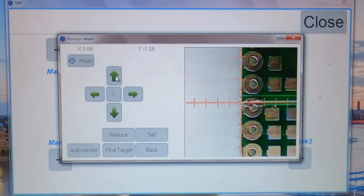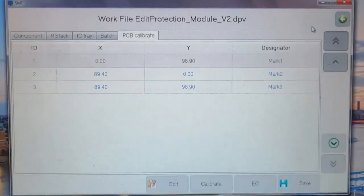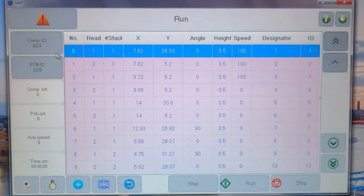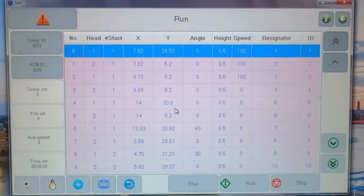With the board in the machine, click on the calibrate button and go through your two or three calibration locations to verify they are where you expect them to be. Once that's done, the rest of the process is exactly the same as before and is saved as part of the job. If you now go back to Run and Load, you'll notice in the left-hand corner it's telling us there are 24 components on each board and a total of 20 PCBs to be placed. As long as you've got the step offsets correct, the machine will process each board, step in X and Y by the amount you've told it, and keep going until all boards are processed.